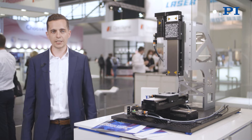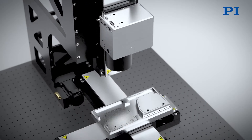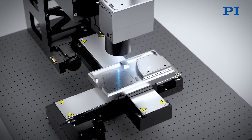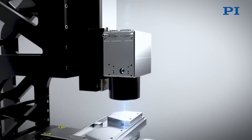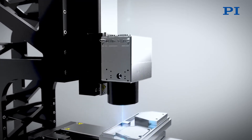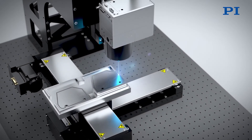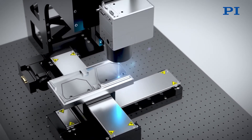One of the methods used in laser seam welding is to move the workpiece to be welded under a laser Galvo scanner head. The Galvo scanner provides numerous additional control features, for example expanding the laser source's effective fine spot size to the seam width, or laying a complex welding pattern over the motion path to create high quality welds.